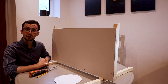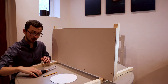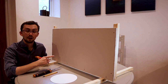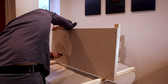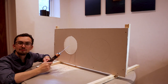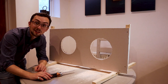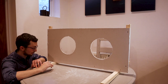So here we have my fake wall. To install this all we're going to need is a pencil, our cutout guide — 210 millimetres by the way — a pad saw, and a Phillips screwdriver. What we're going to do first is draw around our guide on the wall and then cut it out. When I said this would be easy, it's probably a lot easier on a real ceiling that doesn't move all over the place on two dodgy legs on a wobbly table. So I'm hoping your cutting process is a lot easier than mine. There we go — two circles.